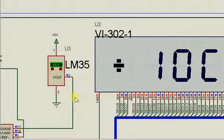on the segment LCD. The positive sign on the LCD denotes positive temperature values, while the C sign indicates that temperature values are in degrees centigrade. We can also observe the correct temperature display on the LCD as we increase or decrease the system temperature. We can also observe that the temperature display system has a precision of 1 degree centigrade.